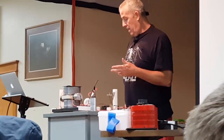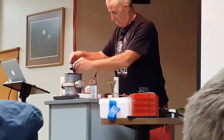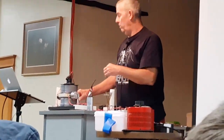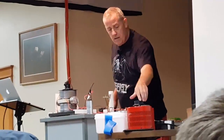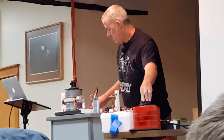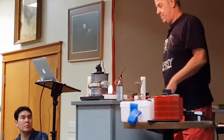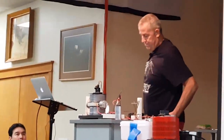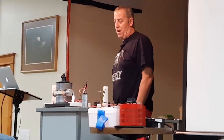Basically, that's it there. And then what happens is we go ahead and we'll put this on. This is a generator coil. It's one of these goofy LEDs and you could actually see it if you had it running. That's 2,000 feet, 1,900 turns, number 25, 68 ohms. I didn't get around to the Henrys or whatever. Can you repeat that?